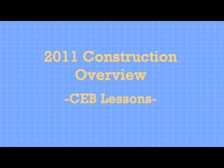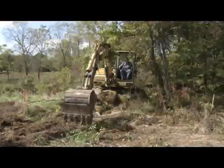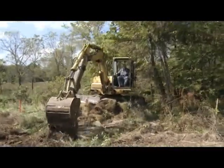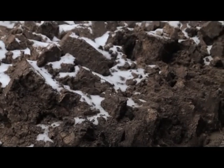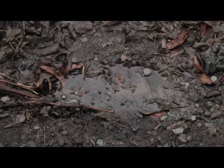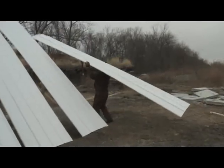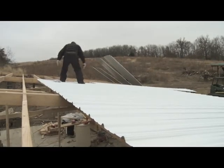What are our main learnings from these construction adventures? Two important points need to be kept in mind for anyone trying to replicate this. One is that huge earth moving capacity is required to do successful, effective building. And two, the great disadvantage is the susceptibility of the bricks to water damage. Fortunately, both of these issues are solvable. In our construction, the soil pulverizer proved itself capable of handling the necessary soil throughput requirements. On the water issue, since we are building at an unfavorable and rainy time, we ended up putting up the roof first and then building the CEB walls. In our area, where rain is common, this is indeed the preferred route for building a structure. Moreover, bricks can be stabilized with 5% cement to make them waterproof.